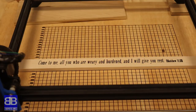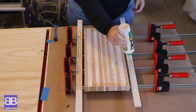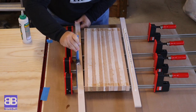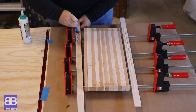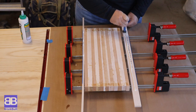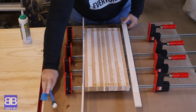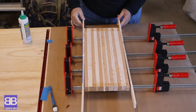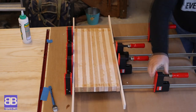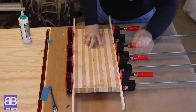Notice that I'm burning these on the last two strips before I glue them to the board. It's easier this way to burn it first, then do a final glue up putting the final two pieces on. I could have done this even sooner and done it all as a single glue up as well. The key is, do it before the final pieces are glued on. Also, this gives you a chance to mess up and do an engraving one more time, which you'll see that I do. If the first burn has an issue, simply turn the strip over and burn again on the other side. The bad burn will simply be glued to the inside of the board, and no one will ever know.